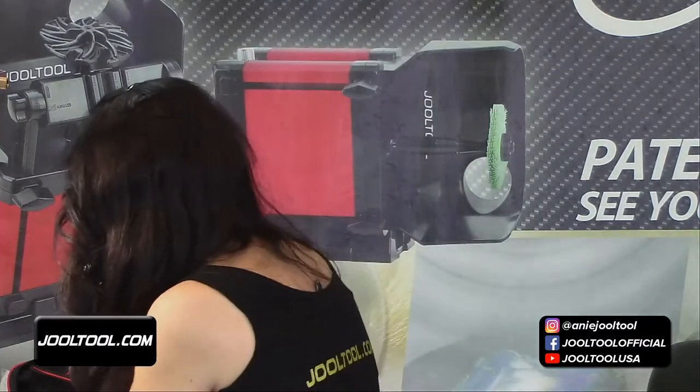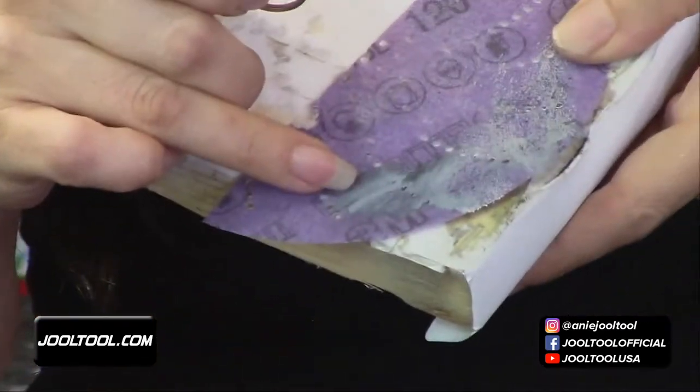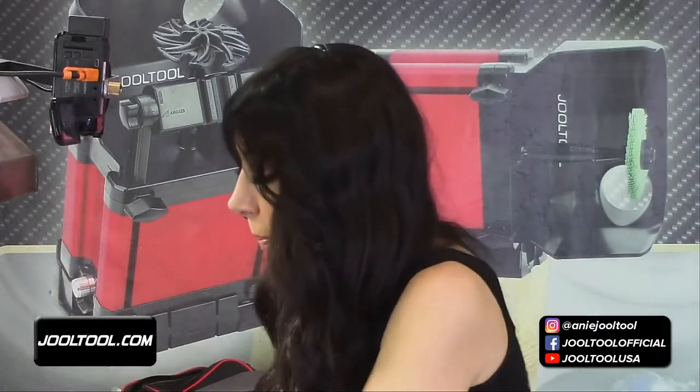Oh, okay. She wants to know which one you use if you have both metal and stone. So that's why I showed you, Lynn, if you got some metal lint on your felt, how to sand it down with a block of sandpaper. You remove the extra and then it'll start getting cleaner. When it's not heavily saturated with metal, it's a really quick little sanding process to take off any surface layer of metal. But if you have one allocated for metal, this is a lot of metal to sand down. You're going to be sanding quite a bit of your felt unnecessarily.